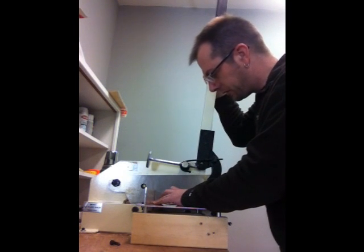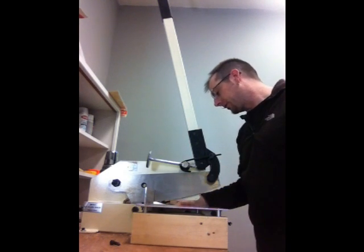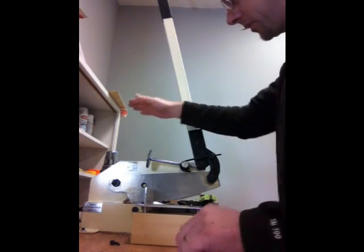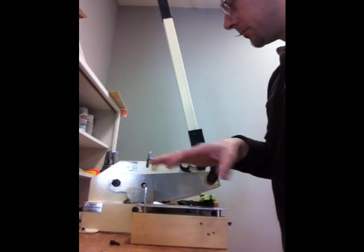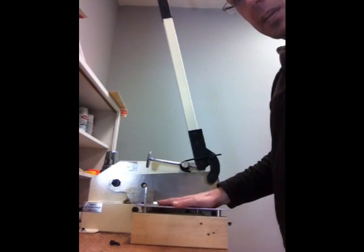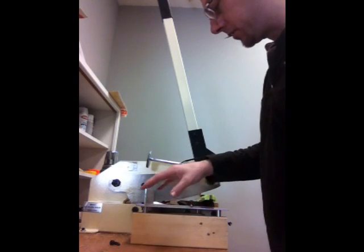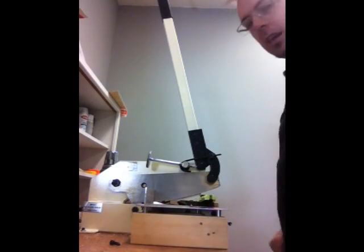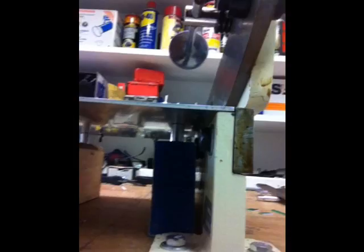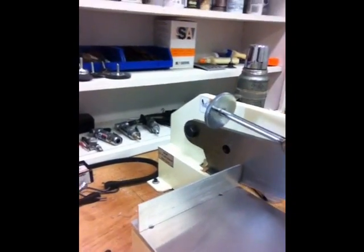This shear has been very useful and I would recommend it. For all of those people asking whether metal shears can do this — they can. I used to have a big tinsmith shear that was rated for PCBs, but for $150 if you're doing lots of micro PCB work, this is a solid option. You will need to build your own squaring bar on the shear table and get it level — I used two-by-fours and spacers, very low tech — but once you do that, you're in business.